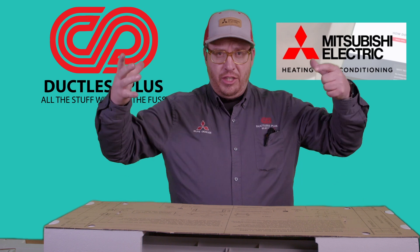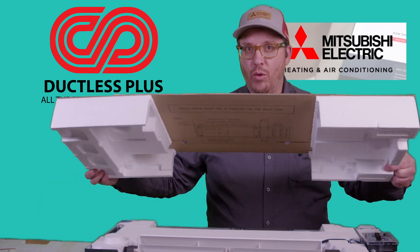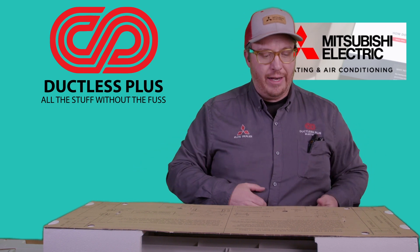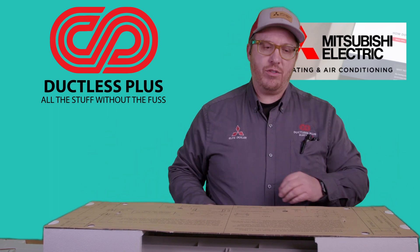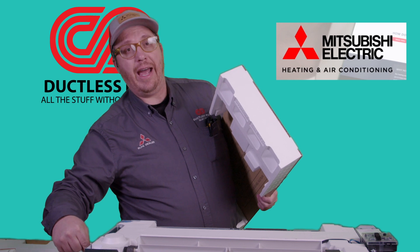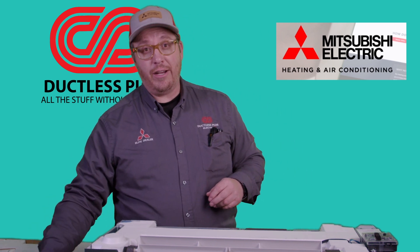Once all the holes are done, your machine is hooked up, and your pipes are done, you're not going to want to put your grill on there because they're going to texture, spray paint, and do all kinds of stuff that could damage your grill. So you want to keep your template intact so you can drop it down, take your screws, drop them in each hole, and tighten them on — then it's going to be protected. Also, when they're doing their drywall, this is their edge that they need to have. I see a lot of times drywallers will tear these off, which is annoying — they'll end up drywalling over the access points on these machines. Drywallers, don't do that — it makes us have to do a lot of extra work cutting the drywall out.